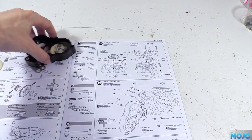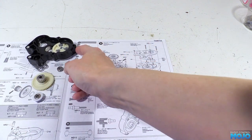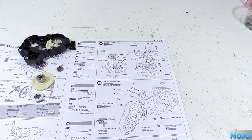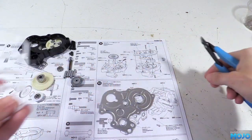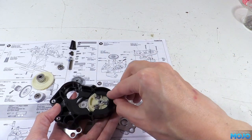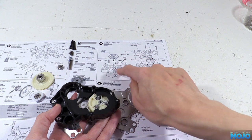Step 9, bringing the gearbox together. This time we need all the bits that we've just put together. The odd bearing is the one from the other side of the spur gear - not too surprisingly it fell out, so I'm keeping it where I can see it. For screws and bits we need three M3x25s, two M3x8s, three M3 nylon nuts, a 21mm shaft for the spur gear to run on, five spacers, the other large bevel gear and the other gearbox cover plate. The plastic: all we need is another B1 for the end of the gear shaft and the other B2 with its bearing. First we'll go around the edge and drop in the spacers. These ones aren't keyed, so their job is only to support the plastic when we tighten up the screws so nothing gets crushed.